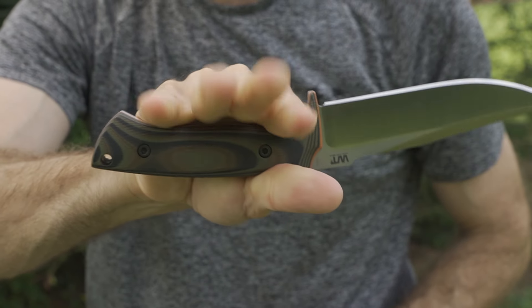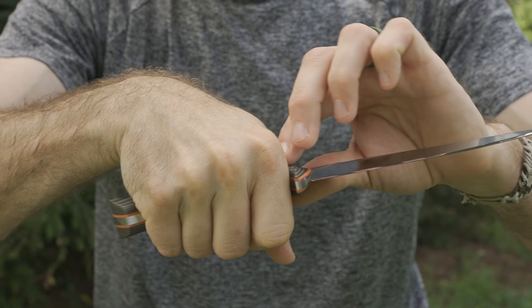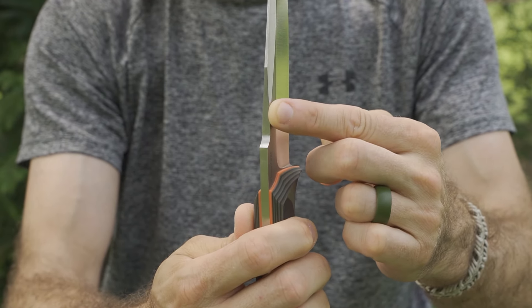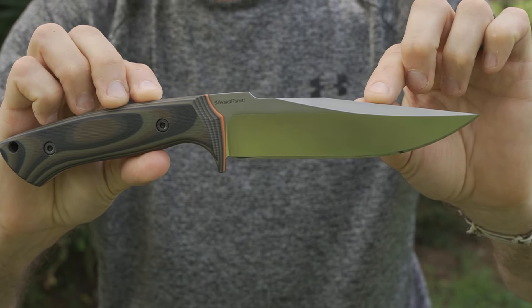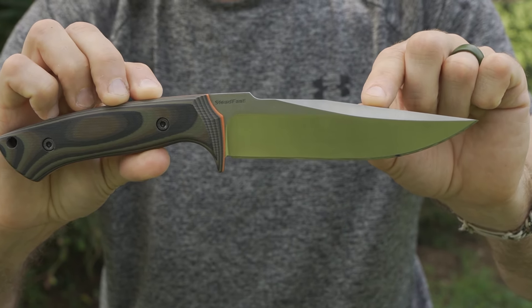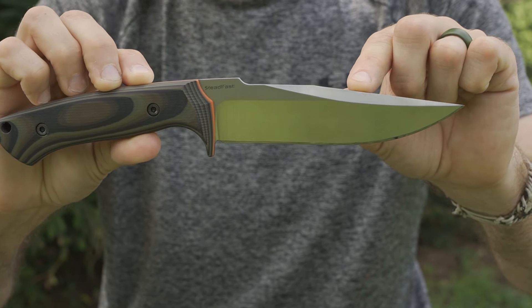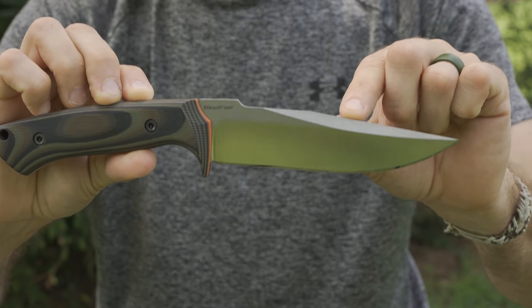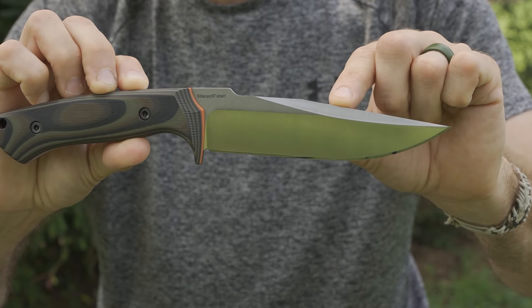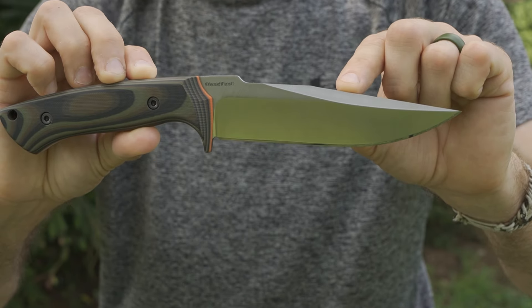You can see here as I grip the knife, we have about 4 full inches clear between the guard and the back end of the pommel. I have a large size hand and this is definitely fitting me nicely. When it comes down to the blade steel, we have a 3/16th inch thick spine, Böhler K390. From what I've come to understand, it's in essence a tool steel that can be generally characterized as having excellent toughness and excellent wear resistance.